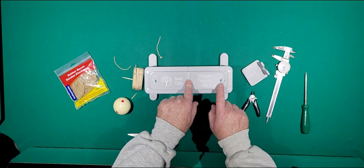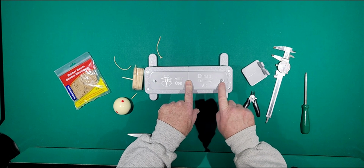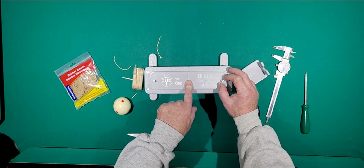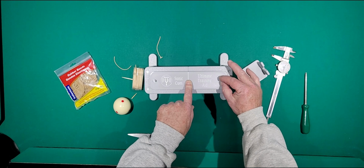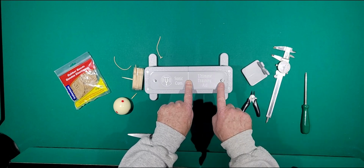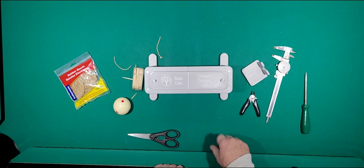As long as you, on a regular basis, whenever you put these screws back in, do that backward rotation. There's the drop into the beginning of the thread. Now, easily by hand, I can get started on that thread. So that is in the original thread that was there the first time. You're not going to be tearing up the sides of the hole down there and cutting all new threads all the time and just making a mess of it over the years.